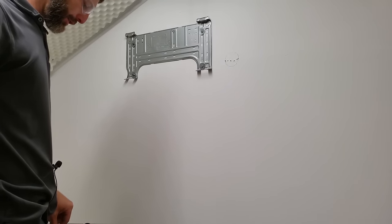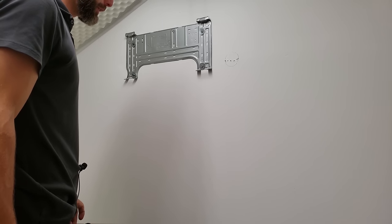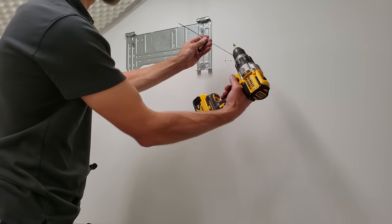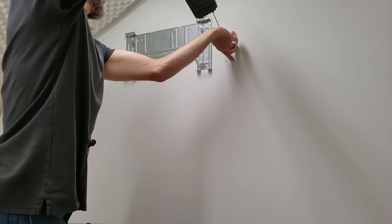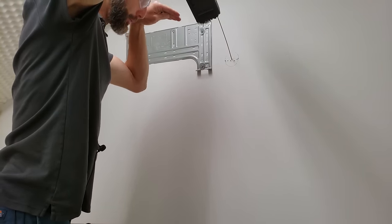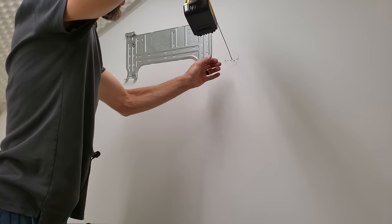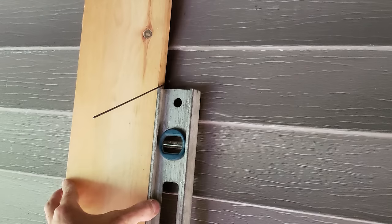There's nothing in our wall — here is our stud, and here is our stud. We need to make sure we have an empty cavity right here. Before I take my hole saw through, I'm going to take my probe — this is an insulation hanger. You could also use a coat hanger. I'm going to go downhill because that's where I'm going to run the line set — downwards for the condensate and for the line set. Now I'm going to go outside and take a look at that. Our probe is in a good location, and our piece of wood and level bringing it down to where the mini-split is shows everything is in line. So I can go back in and drill our hole.